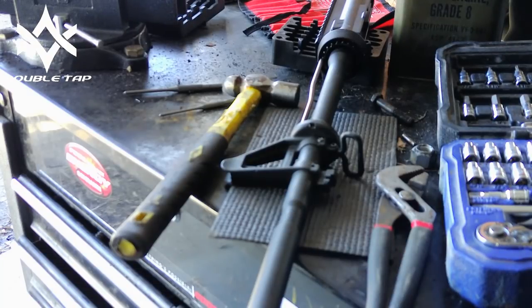There are two different gauge types. I didn't dig mine out because this gun's bolt and barrel have been used together before, so there's no need for me to headspace this. But if this was a brand new build — brand new barrel, brand new bolt carrier — you would absolutely want to headspace it. Keep that in your knowledge base.